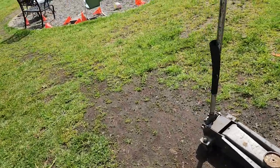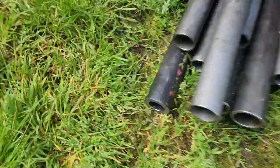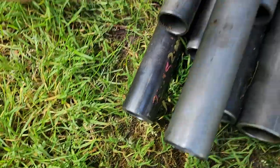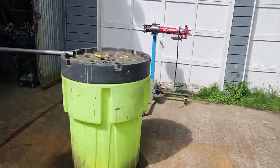Here is the tube. If you can see, this one is pretty clean compared to what I usually get — I just picked these ones up yesterday. But what I'm talking about is most of them have black mill scale and are covered in this grease. People are just welding over that, so I figured I'm gonna show you what I do.